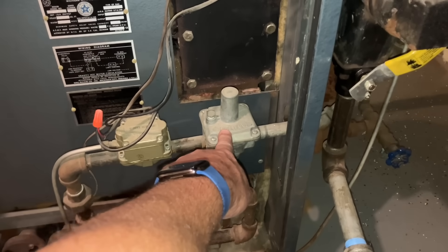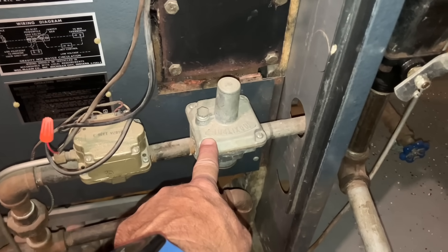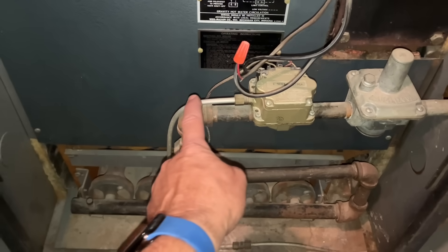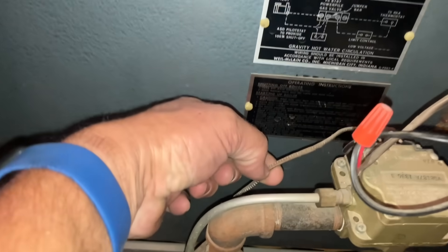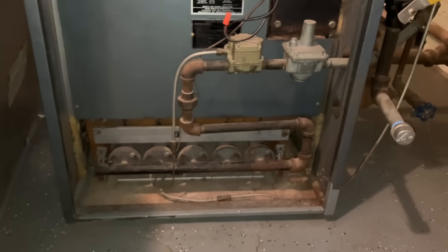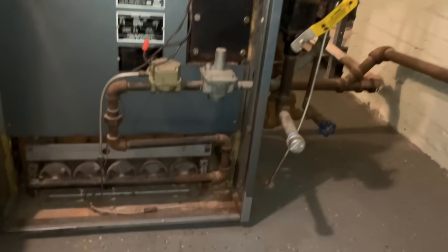Here is that gas setup. You have your half-inch gas coming in. You have a gas pressure regulator, and here's that gas valve. The gas valve also has a little pilot tubing here going to like a little thermocouple-looking thing. But also notice that you have this wire, which has some metal on it, going to two terminals in the gas valve. So this is a millivolt gas valve. God help the homeowner when this dies, because you have to redo everything in its entirety.